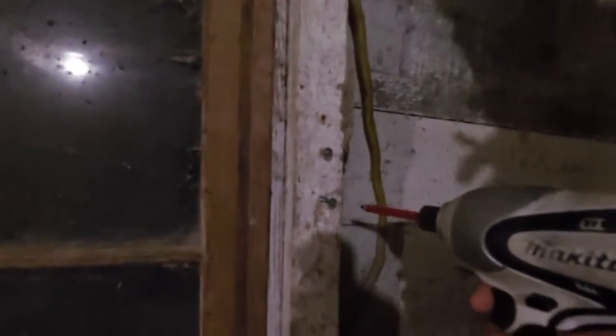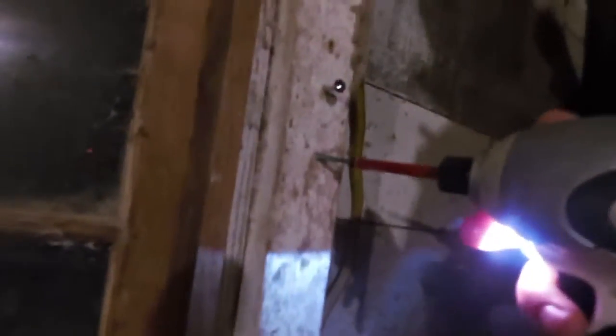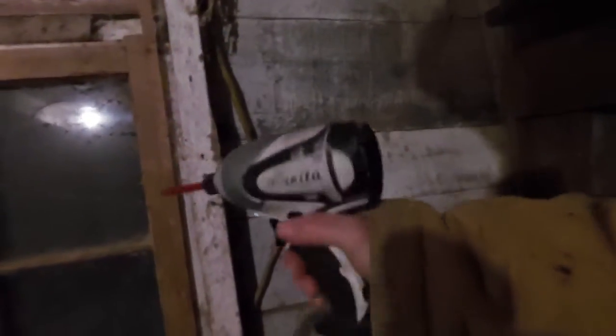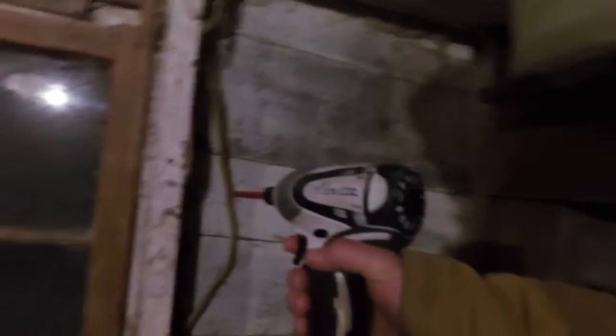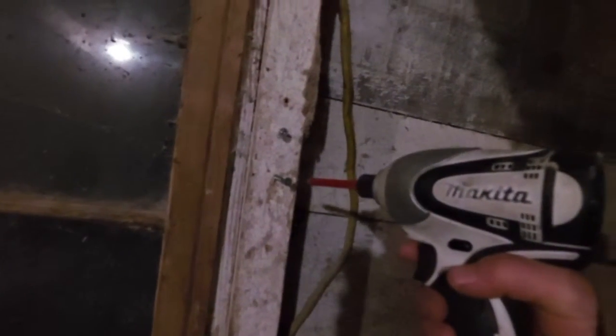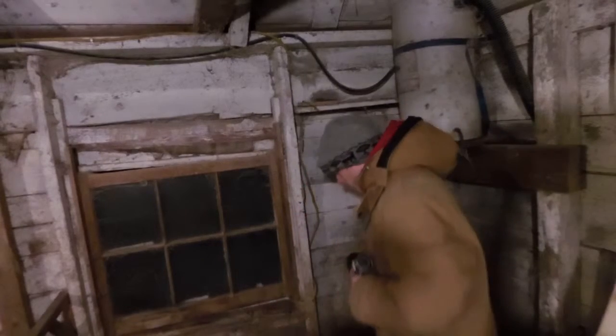For anything two and a half to three inches long, the impact is great. For short screws — one inch, two inch — there is not going to be a lot of torque required, so I don't necessarily need to use an impact. Although the impact is nice and light, I don't like the noise it creates. With the drill driver I have more options, such as the torque collar for screwing.